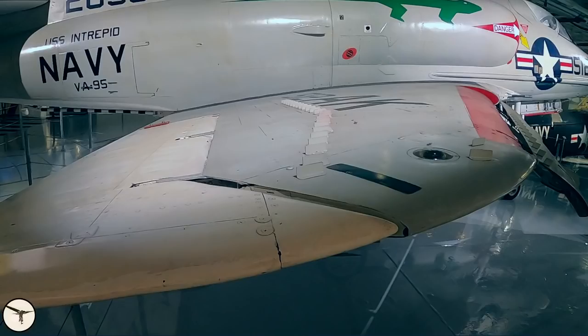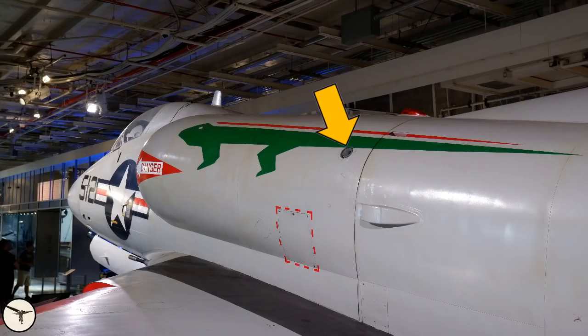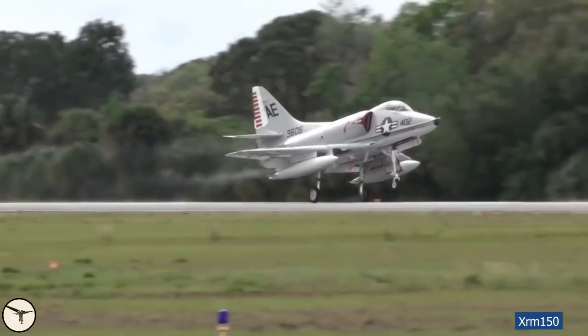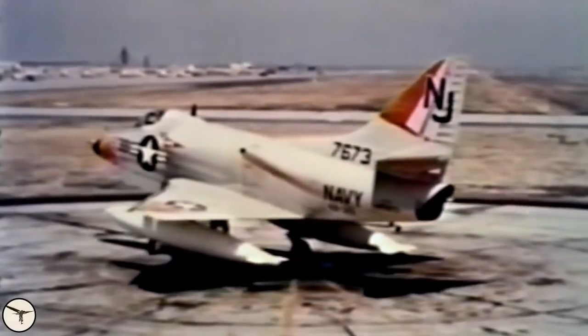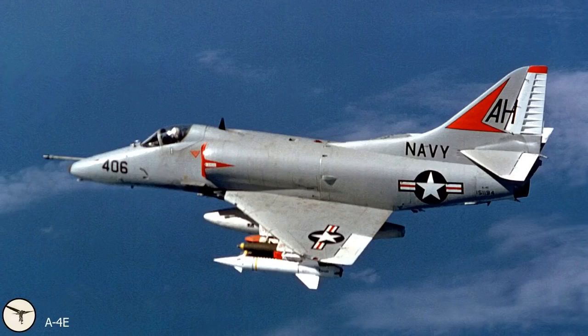This red oval marks the outlet for engine cooling. Jet engines use oil to cool the hot sections, and the J65 is no exception. What makes the J65 special is that the hot oil vapors are exhausted overboard — there is a second outlet on the port side, a bit higher up. The smoke you see on video is vaporized oil venting from the engine. Private owners know to wipe off the oil after every flight, but in wartime operations there was no time for cosmetics. As a result, Skyhawks developed oil stains on both sides of the fuselage. Despite being able to refuel air-to-air, the endurance of the A4 is limited by the oil supply — the tank holds 4 US gallons and consumption is 1 to 2 quarts per hour. The A4E introduced the J52 engine, which recycles the oil, so no more oil spill.